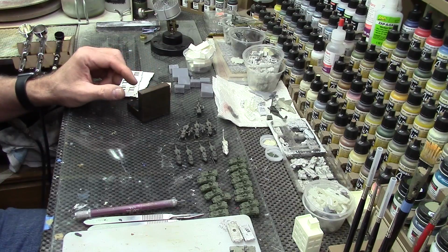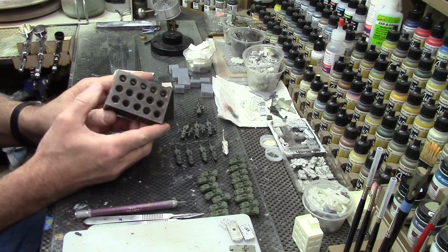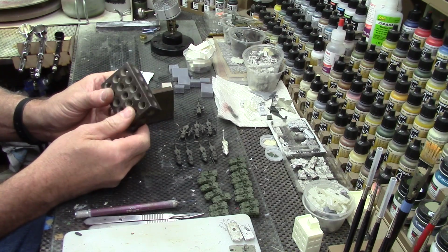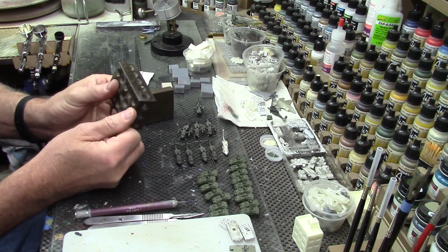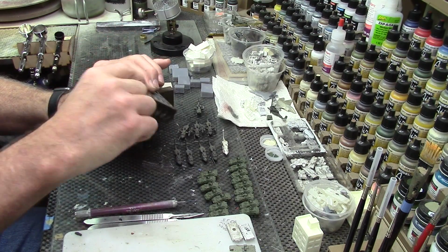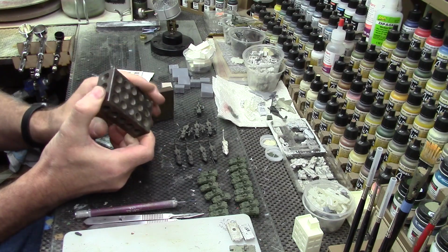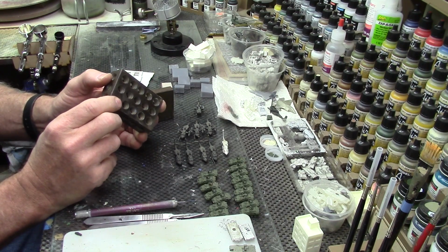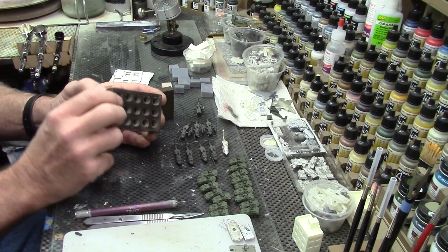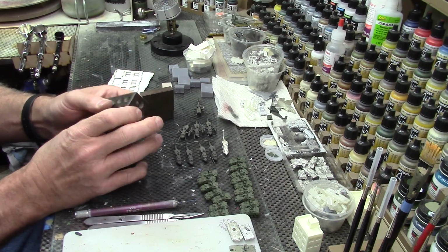While I'm on the topic of 90-degree square machinist things, the other good old standby is what's called a 1-2-3 block. If you can guess why this is called a 1-2-3 block, you win a prize. The reason why it's called a 1-2-3 block, if you've already given up, is that it's 1 inch by 2 inches by 3 inches. And when I say 1 inch by 2 inches by 3 inches, I don't mean 1 inch and 1,000th, or 999 thousandths. I mean it's exactly an inch. Again, that's critical to machinists when they're setting up, not as critical to us.